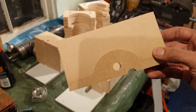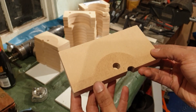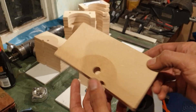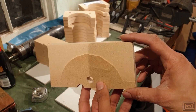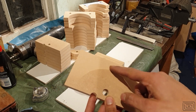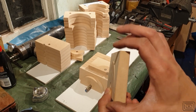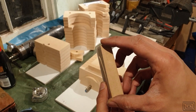Some parts came out a lot better than I thought they would. On this one I've put a taper in — you can see the end mill doing an almost 3D milling contour path and they came out quite clean. Some areas didn't come out as well, partly due to programming, but this is absolutely fine for what I need. I couldn't leave them flat because pulling the mould out over that distance would pull the sand, so there's a 2 degree taper on these.